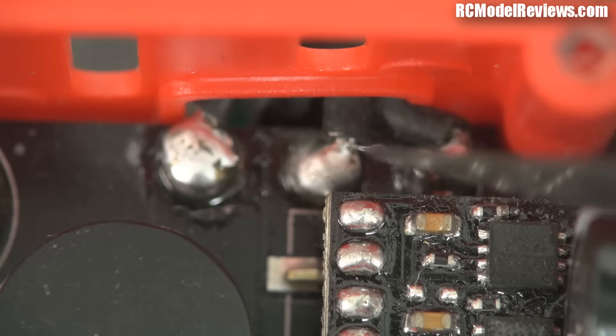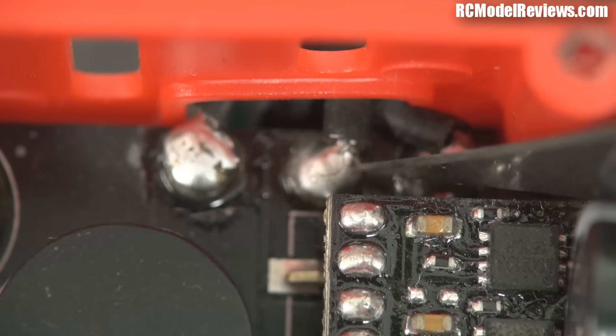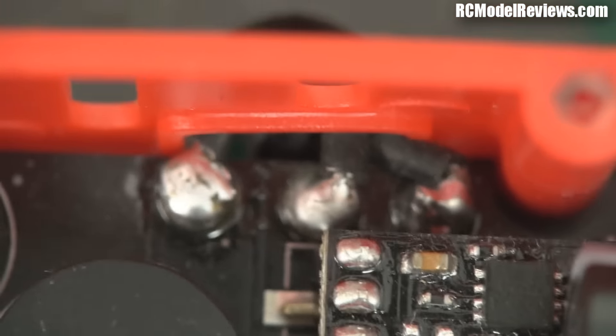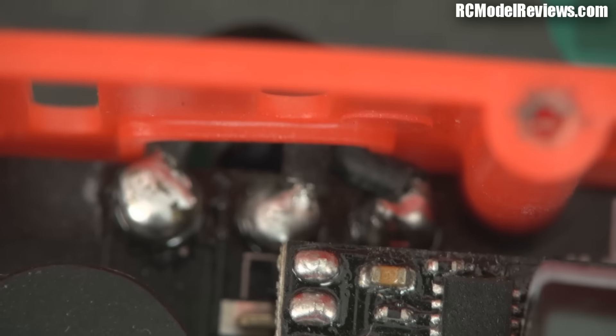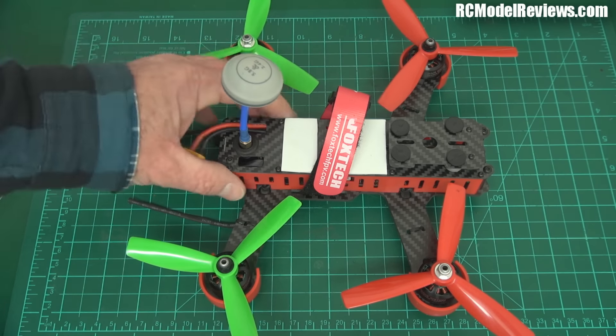Look what I found - here is a tiny sliver of wire from the middle wire on this ESC where it joins onto the PDB, and it was almost touching the other connection. If it had touched, boom - smoke would have come out and one of those fancy ESCs would be toast. More importantly, that piece of wire broke off with just a little bit of flexing and was floating around inside - it could have shorted out the flight controller, ESCs, anything inside the frame. The quality of those solder joints where the ESC wires join onto the PDB is not good. They're using lead-free solder, there are little dark inclusions, wires at an angle, not sitting directly over the pad. DYS really could have improved that.